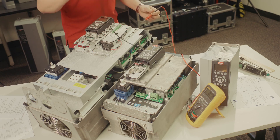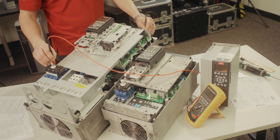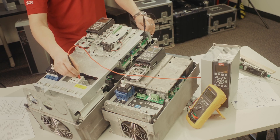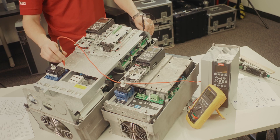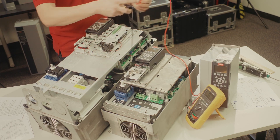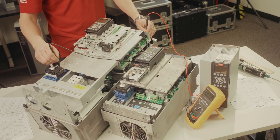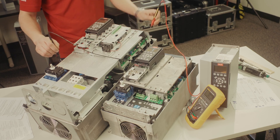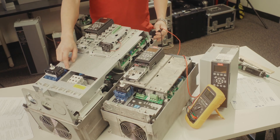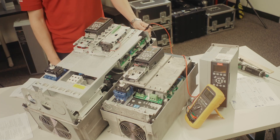The main test we are looking at is when we go negative meter lead to positive — we're looking for those diode drops. So make sure that we have that on our input section as well, because again this should be our reading to infinity, but it's not; it's actually reading low. So we have a connection. We're going to go ahead and swap our leads and go positive to positive — we're going to get our reading to infinity here as well. And we do have a reading to infinity here, which is good. Just make sure you don't have that DC bus charged up. If you see that voltage start to climb up, jump right to the next point when you're testing it. Otherwise you're going to charge it up and you'll just read OL across all — again, that is just showing open, but we're looking actually for infinity.